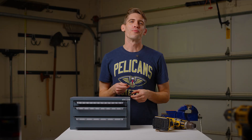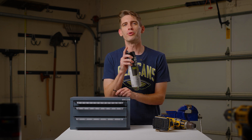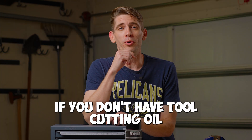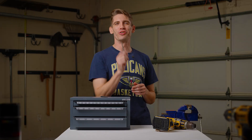For our test, we're going to take each of these drill bits and drill a hole in a grade 8 nut. To make drilling your holes easier and increase the life of your bit, tool-cutting oil is definitely recommended. If you don't have tool-cutting oil, a little dab of transmission fluid will do you just fine. So let's show you what I'm talking about.